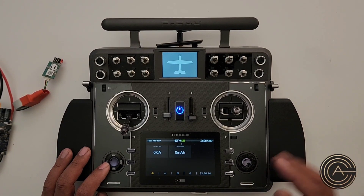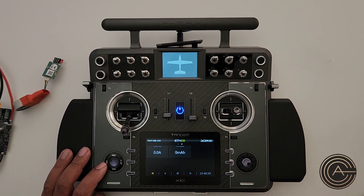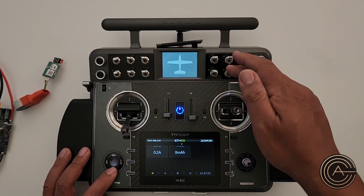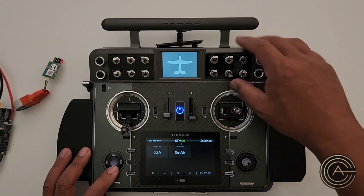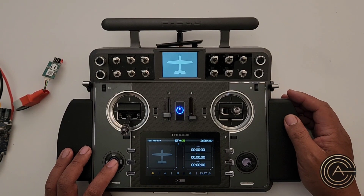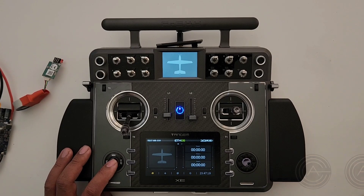That's it. We set up displays, some audible callouts — zero milliamp-hours, zero amps — a warning that tells you when you're over 4000 milliamps and keeps repeating the consumption value, a switch to turn off that warning if it gets annoying, and a reset that clears all telemetry and timers before flight. If you guys have any questions, feel free to leave a comment. Like and subscribe — thanks very much and have a good day.